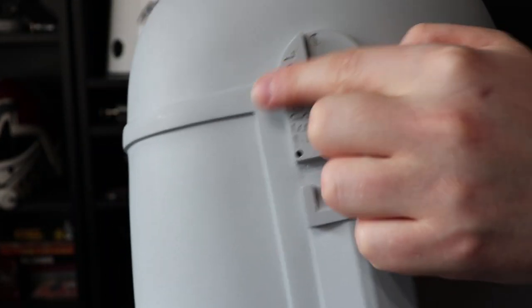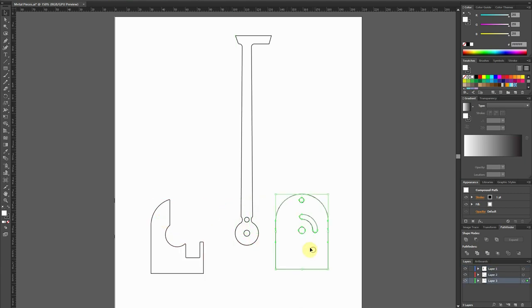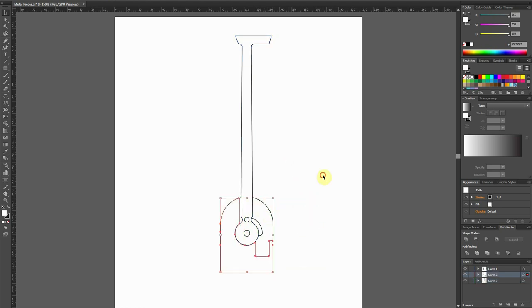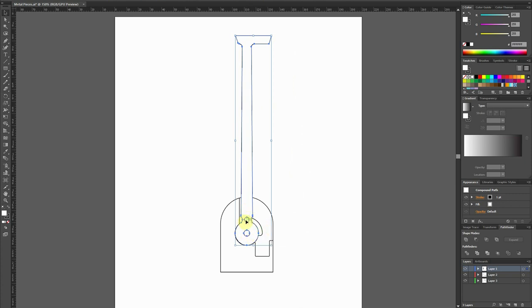Now it's time to sort out this area by designing my new pieces. Here's what I've come up with in Illustrator — I've drawn out the parts I need on different layers. We've got the base plate, the cover piece, and the stalk. The cover piece and stalk are going to be cut out of 6mm aluminium, and then hopefully the base plate will be 1 or 2mm. They layer up, the stalk slots into the base and can pivot. I've left a hole for a servo — a rod that can pivot around that point.